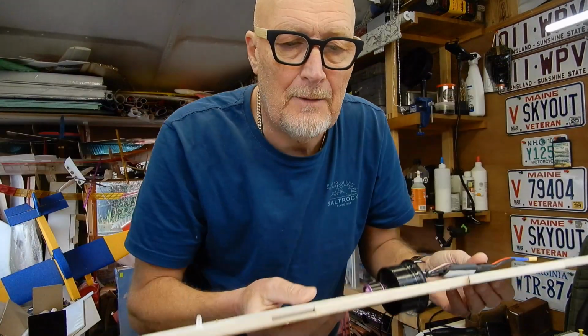Right, wood on one side. Now I've got to start forward thinking about this, because obviously I've got to put the servo in, because the servo is going to get hidden with the sheet this side. I've got to think about where the fan's going, and also with the receiver and the battery. I'd like, if I can, to try and hide the receiver and hide the speed controller with possibly a little fairing over it, but I don't want to get over complicated, and particularly the speed controller. I'd like to see that get some cool air over it, so I might just come up with a little sort of aerodynamic looking box for the receiver, and I'll see how I go with the speed controller. I might be able to do something that's got a little bit of venting to it.